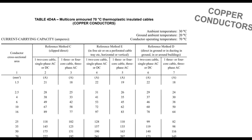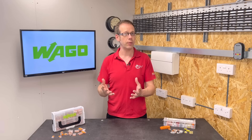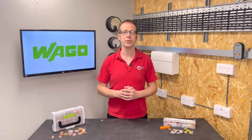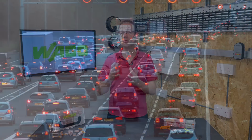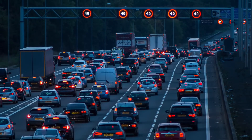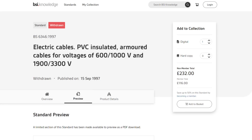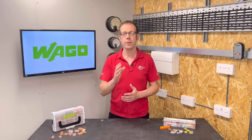If we flip back a few pages to Table 4D4A, we find that the equivalent size cable installed in the same way but with 70 degree insulation is capable of carrying only 41 amps. So great news — we can use cable with insulation rated at 90 degrees C and it can carry more current, meaning we might be able to get away with installing smaller cables. Couple this with the fact that, apart from small batches for specialised uses such as traffic signals, SWA with PVC insulated conductors isn't really manufactured anymore.